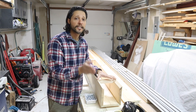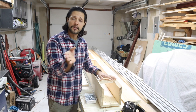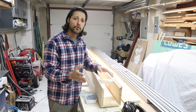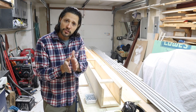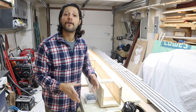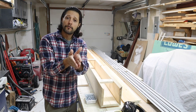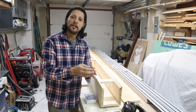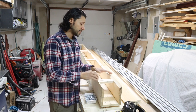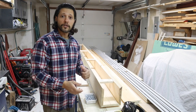The biggest problem is going to be jointing those long boards to get miter folds perfect. If you don't start with a straight edge, your miter folds are never going to be straight. You can't run them through the table saw along the rip fence because the waves, crowns, cupping, and twisting in the board will telegraph right into the blade, and when you fold up those miters you'll have a lot of gaps.